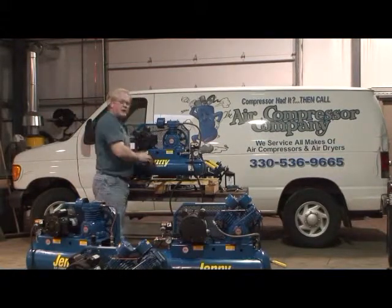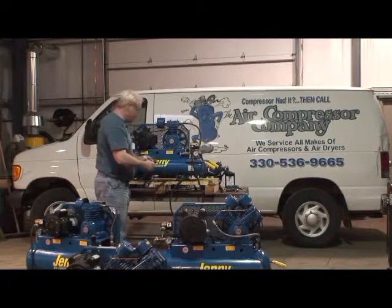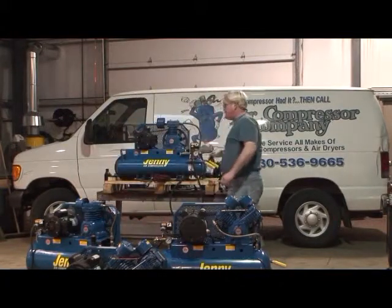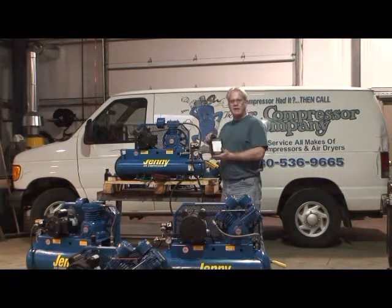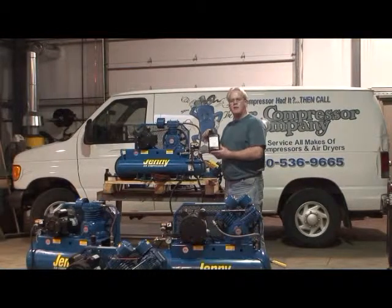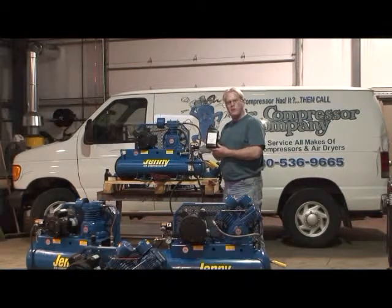At this point, now you're ready to put oil back in the compressor itself. As I mentioned, we like to use only synthetic naphthenic-based compressor oils. Conventional motor oils that you purchase at your parts store, even synthetic motor oils, will not be able to withstand the operating temperatures that are present in an air compressor.